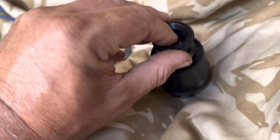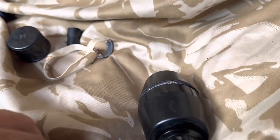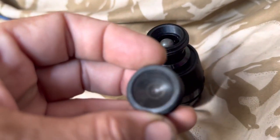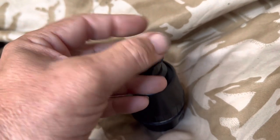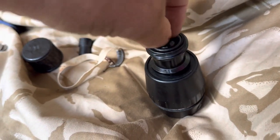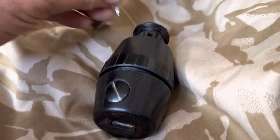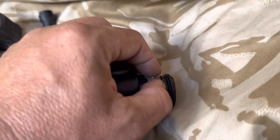The little tiny creep spring keeps the firing pin away from the firing cap at the bottom of the hole. That sits inside the top of the fuse body, and there's a little tiny round recess which the ball bearing — or musket ball, it looks like a musket ball — sits in. Then this concave cover screws down over the top. This is now in high explosive configuration; the pin would go through the hole in the shaft of the firing pin to keep it away from the priming cap at the bottom.